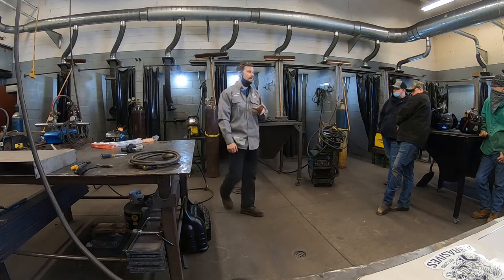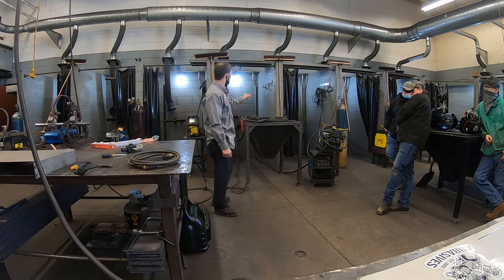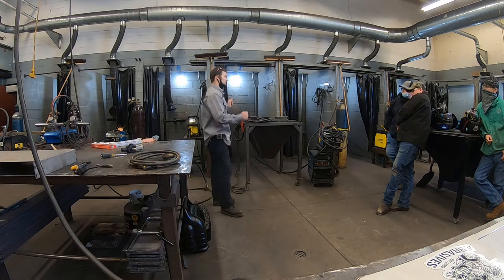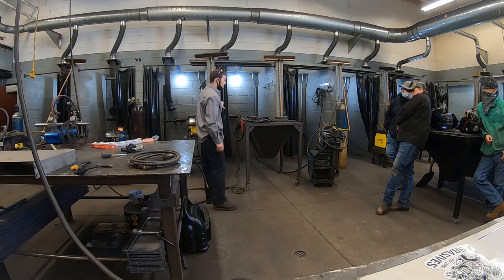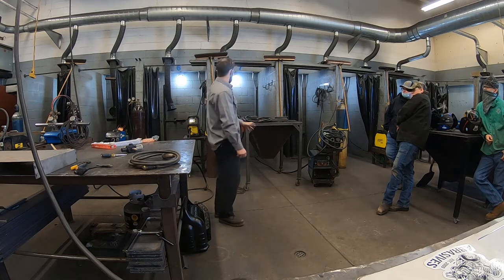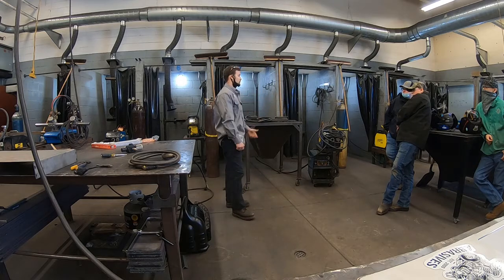Another thing to consider: I've brought the welder out of this booth. If you were doing this somewhere else, you'd want to make sure you're blowing all of this molten metal away from the shop — not across it. So we brought this over so if there's nothing in the booth, we're going to take all that molten metal and blow it into the booth. If you don't have a booth or a downdraft table, you'd go grab a 6x6 screen and set that up wherever you're going to be working.